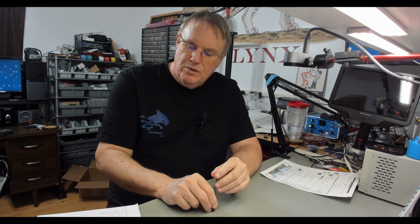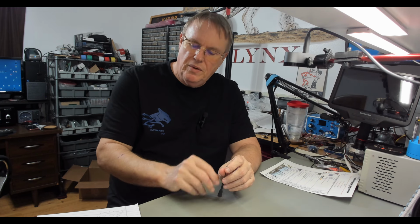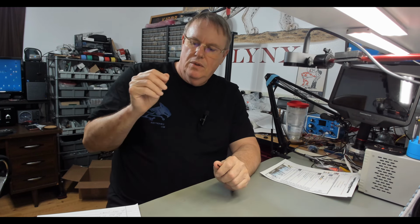Who should not buy a Hexbeam? People with serious ice storms, already said that. If you have other multi-element beams, probably a Hexbeam isn't a choice for you. Because if you're running a 4-element Yagi, it's going to have a lot more gain, a lot more front to back ratio than a Hexbeam. So why would you buy a Hexbeam?